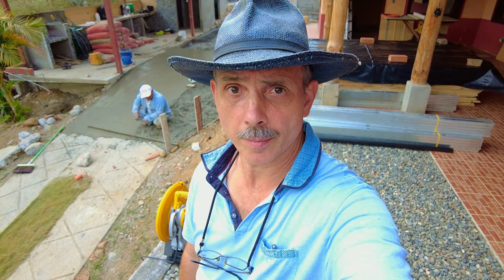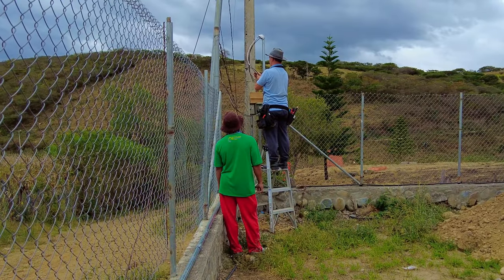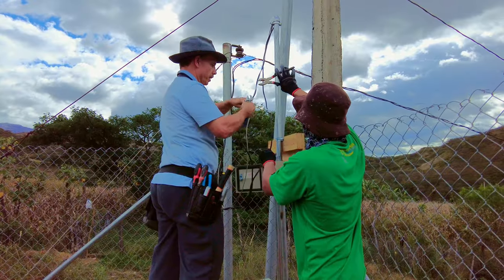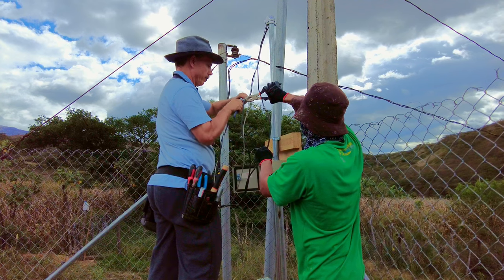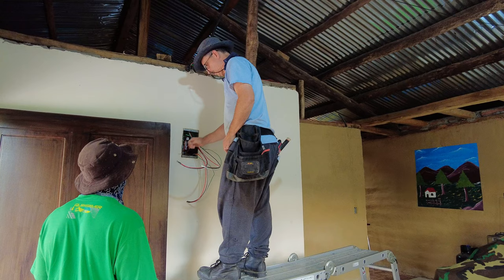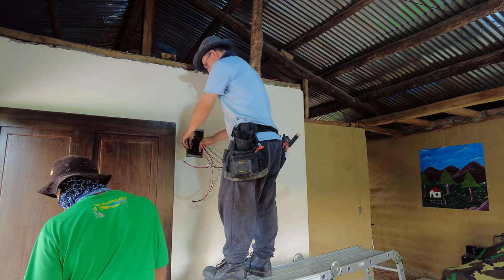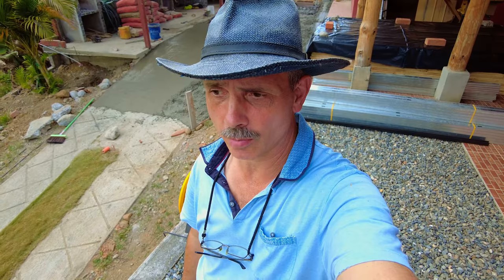Anyway, the battle continues. We managed to get, as I mentioned earlier, the light changed over, the power connection changed over from the ridiculously goofy wire they had running up the house before, up to our new system with two separate breakers, a new panel, larger cable. I've managed to hook in the plug-ins in the kitchen and a few of the lights using the old breaker panel, which is now just a junction box.